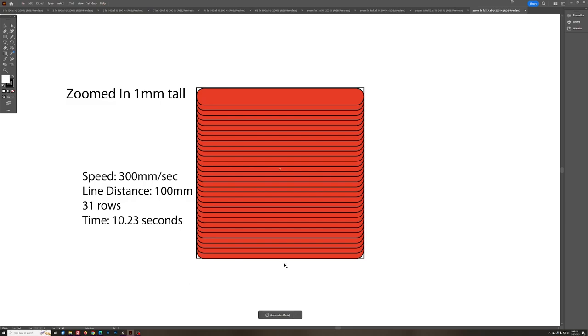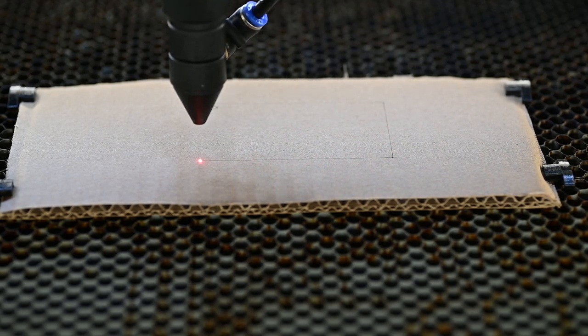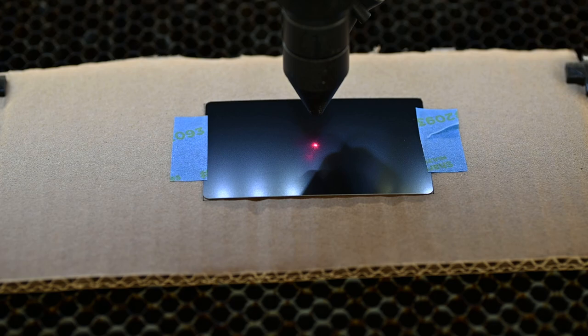So that's a rough visual look at how LPI works. Now we're going to go out to the laser, take some of those metal business cards, and engrave some patterns. Then we'll take those to the microscope and see what we get. The first thing we're going to do is make a little outline so it's easier to place the card in the laser and make sure everything lines up. Now that the card is placed, we'll tape it down since the air assist is enough to blow such a thin card away, and run a test pattern to verify good speed and power settings before doing the LPI test.